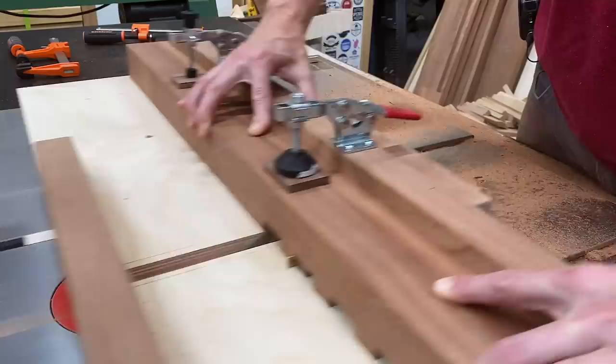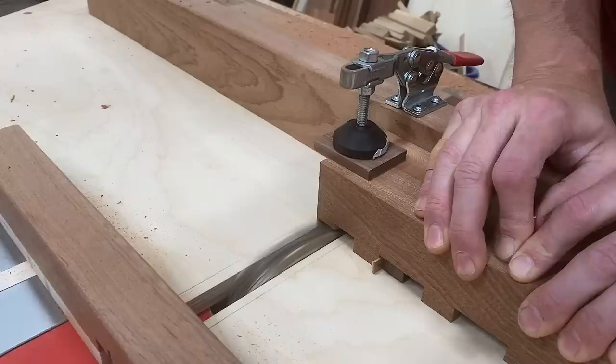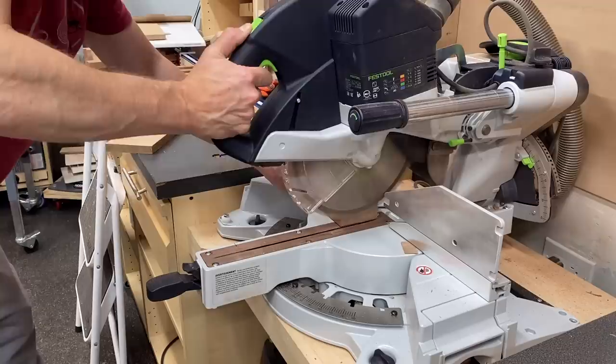If you happen to buy plans to build one of these benches, you don't necessarily need a dado stack — you can do it with a single blade and just keep making pass after pass, or you can set up some kind of router jig. I cut a little close on the end there — a little bit over is better than a little bit under. And there are 20 equally sized and spaced dadoes — well 40 really, because there are two pieces. Then I could trim off the waste at the end, check it for flush.